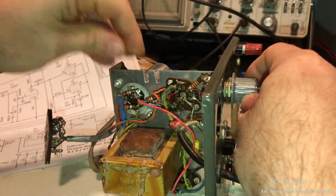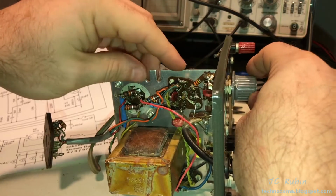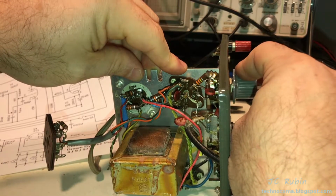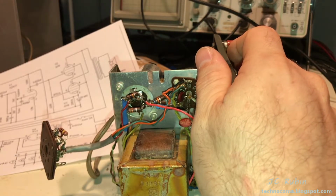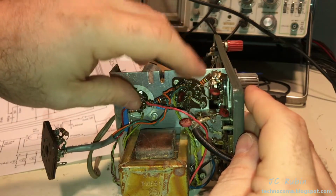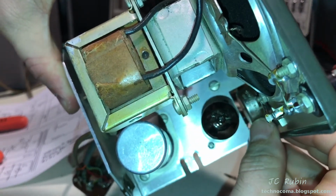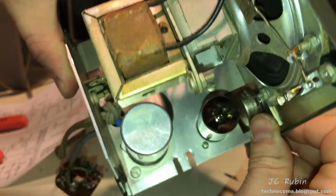And there's a volume knob somewhere in here, and this is going to be the only potentiometer for the first iteration of this. There's not going to be any tone control yet. It'll be a set value, a set passive component that's going to go in there. But I just can't see working on this. This is just clip it out and start anew. One saving grace though, the volume knob is a 1 meg pot, so it looks like that one can stay. If I get another 1 meg pot, that would make a good tone knob.